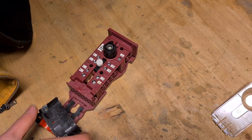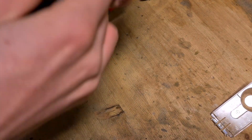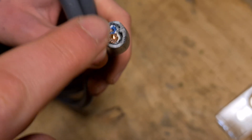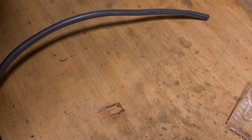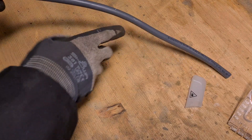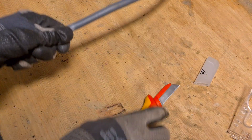Let's wire this fixture fuse box up. I only have a single phase cable — as you can see just a brown wire and a blue wire, and the ground is inside, this copper-colored wire between all the other wires. Obviously you want to start with stripping the wire. I'd recommend stripping it around 40 centimeters so you have enough cable — especially enough ground — to ground every type of pole.